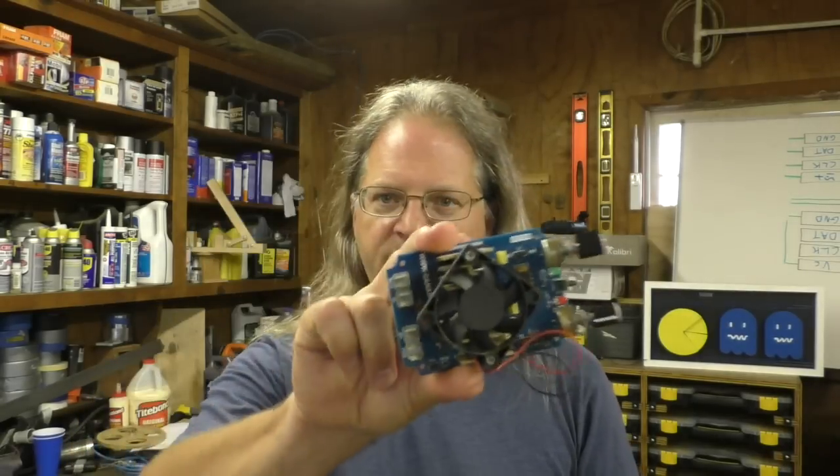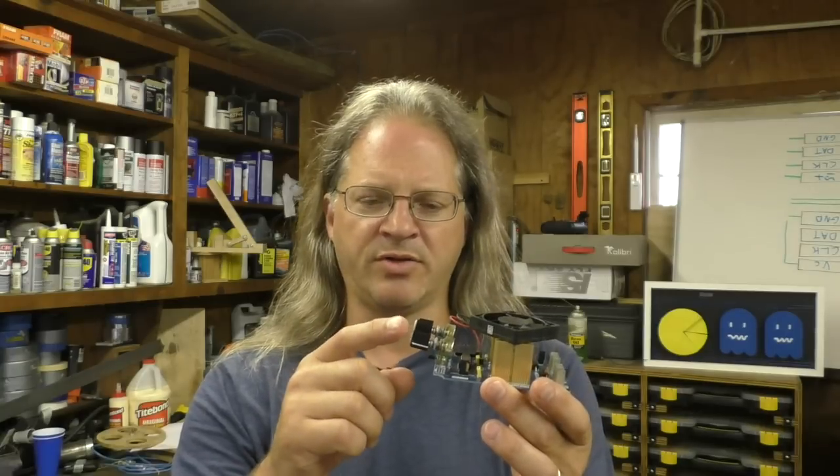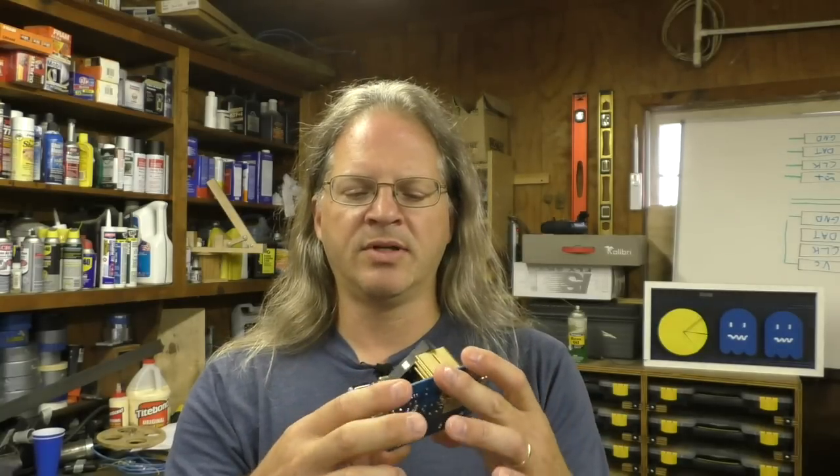So there is the first run of the filament extruder. A couple of things: the motor controller — SparkFun no longer sells it, it's on their retired product list, but CannaKit is still in business and you can buy it from their website. I'd forgotten just how nice this motor controller is — it's about 50 amps continuous current, goes up to 30 volts, and you can control the pulse width modulation frequency and duty cycle. I think I'm going to put this in the filament extruder instead of buying another one.